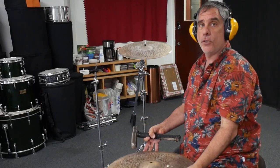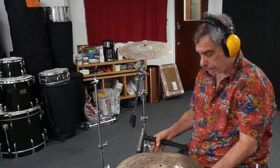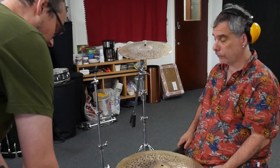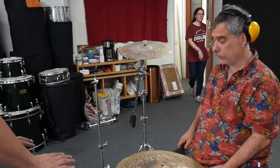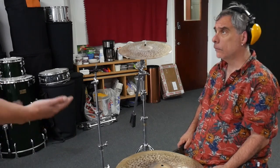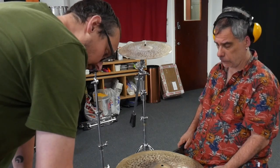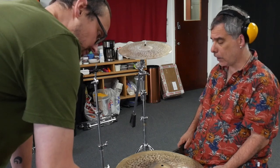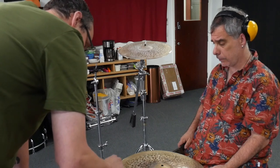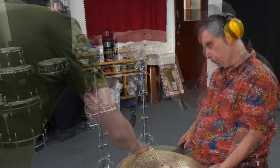So I'm going intuitively here. Yeah, okay. Let me just see what's going on. Because the profile starts becoming high and strong, you can, like I was saying, if the cymbal's low and you start hammering on the top, if the profile's low, it can fold inwards and take that top work too far. But what we can actually start doing now is coming out, we need to get closer to the edge. Just to even the shape out all around. Because you've got a nice climb from the edge up into the shape, you can start hammering on the top.